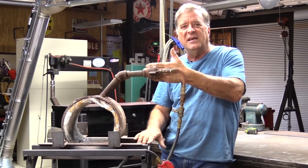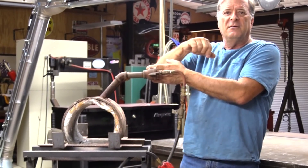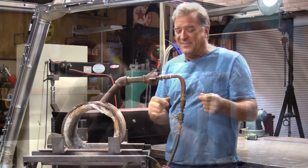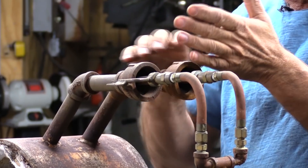Get a piece of steel and put it in between these two. Sniff over here — no smell. Sniff over here — now I have a smell. We're narrowing in on it. The problem has to be somewhere in this pipe, in this section right in here.